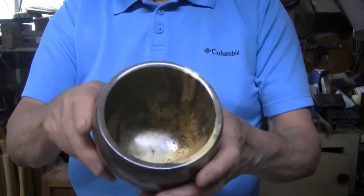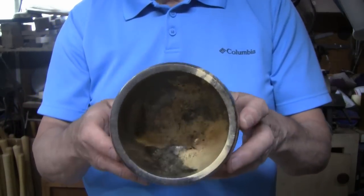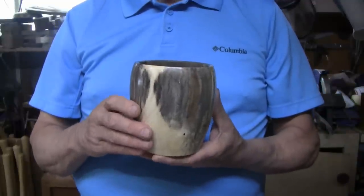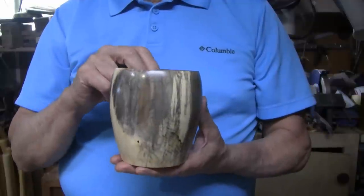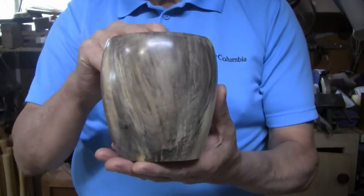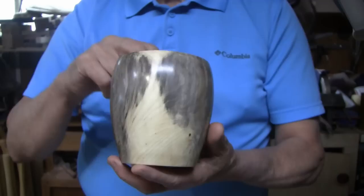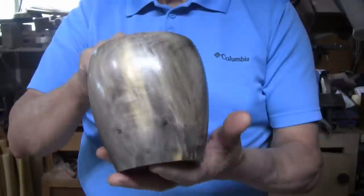And look at the inside, I think it's actually got some spalting in there. It's interesting colors in this piece. I finished it with three coats of Zinsser seal coat, two coats of the Zinsser shellac, and I then went over it with the abrasive paste and polish. It turned out very smooth, and it really helped show off those colors. This, I really like that. That's pretty interesting. And then over here is where you can see some nice chatoyance.